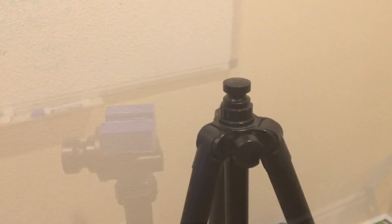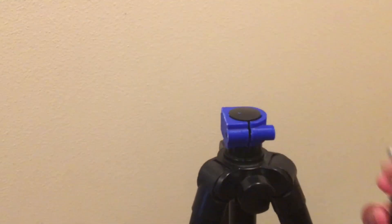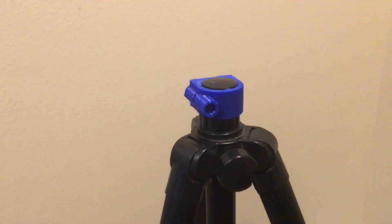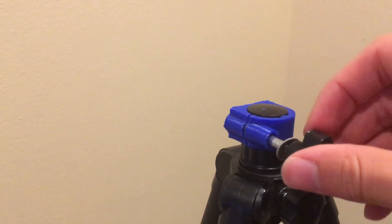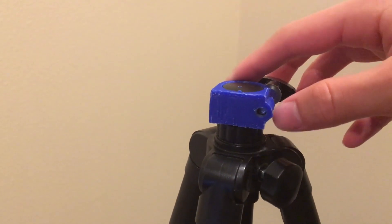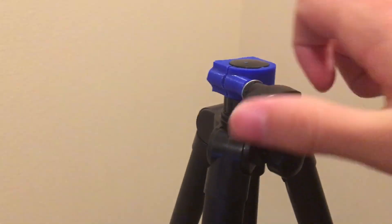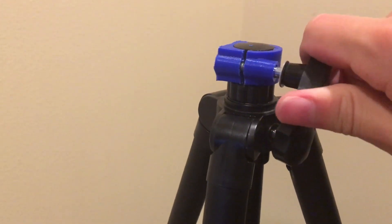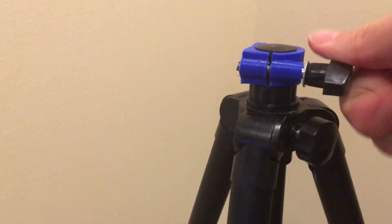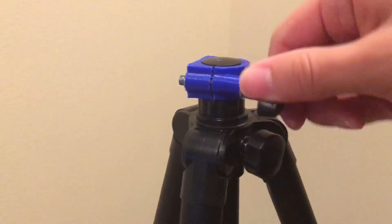I printed this piece which fits right on top, but it pulls out when the screw isn't in, which is why there's this piece that replicates the original to keep it seated. I found the right thread size — 5.5 millimeters for this tripod — and printed a screw right into the back side. Now tightening it all the way locks it so it can't rotate anymore until loosened.